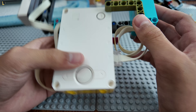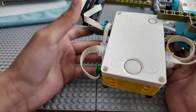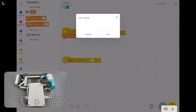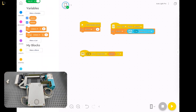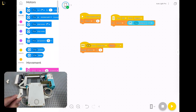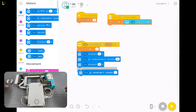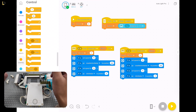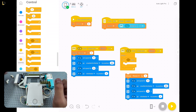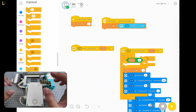The next thing we're going to do is programming. Here's how everything works: on the left side is the wall, and when you walk through, the distance changes. When it changes, it knows somebody has walked through and adds a variable — zero means nobody is there, one means somebody is there. When it detects again it minuses one back to zero.